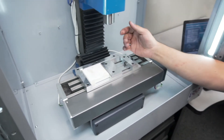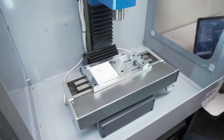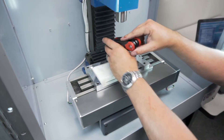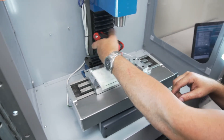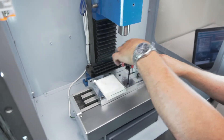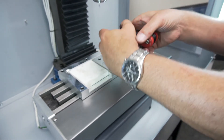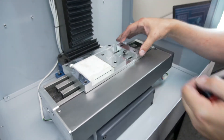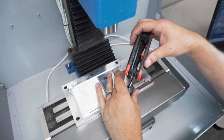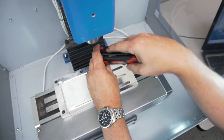We're going to cover both ways. First, we'll put the block on the bottom, set the workpiece in place, and slightly snug up the quarter-20s using our 3/16 hex — just a good snug so it can still slide. Using our 3/8-16 bolt in the back, we want it snug so it can't lift. Tighten it, back it off just a little bit, then bring up our screw block. We want to tighten this one down and make sure it's good and tight so it can't move as we're trying to clamp.